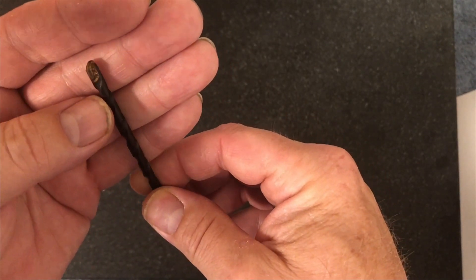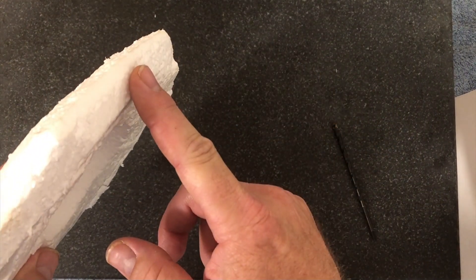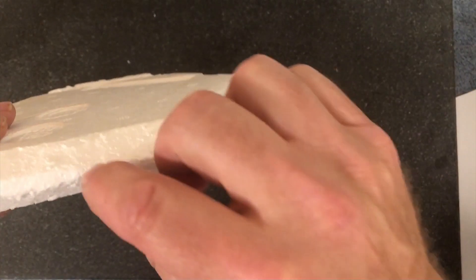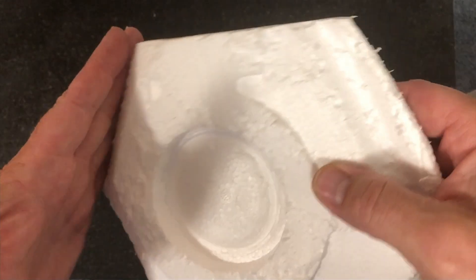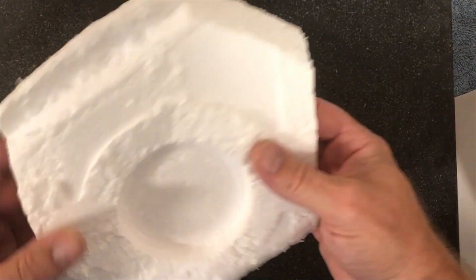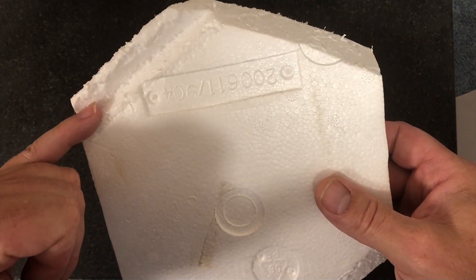This is the bit that I'm going to resharpen. The contours are difficult to see, so I made this piece of foam to show what the contours actually look like. It's rounded here — that's an awesome shape for when you have to hammer into concrete to break up loose debris. It's a negative rake, so it's very strong, but it will not work well for cutting steel because there's nothing for the steel to travel up and it just won't cut well. My plan is to grind the tool bit to look like a spade bit, putting a contoured shape on each side and a gouging point on each side to make a chip relief.